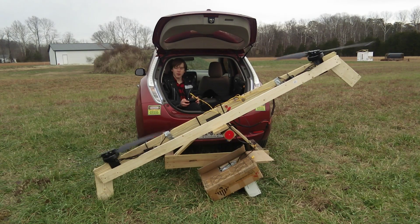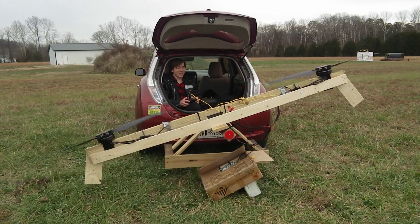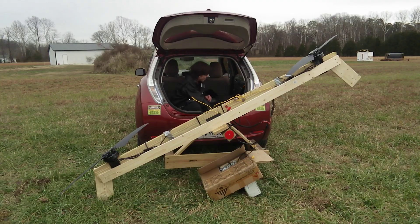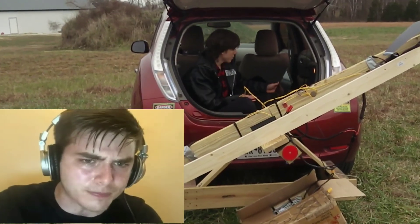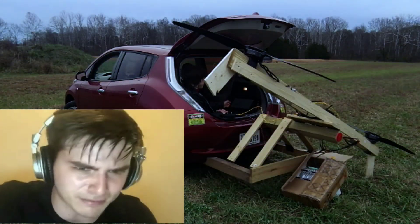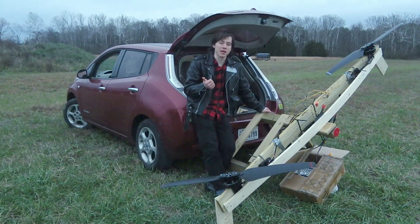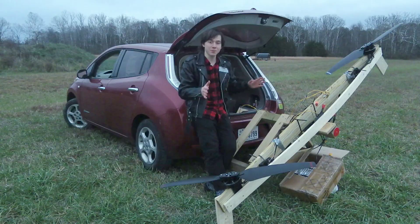All right, arm. Yo, it's working! That is so cool. Number one — the control stick is backwards, at least based on my orientation to the craft. So let's fix that. It's been about an hour. I've gotten the proportional and derivative values tuned in pretty good, at least at low speeds. Now I'm going to crank it up to maximum speed.